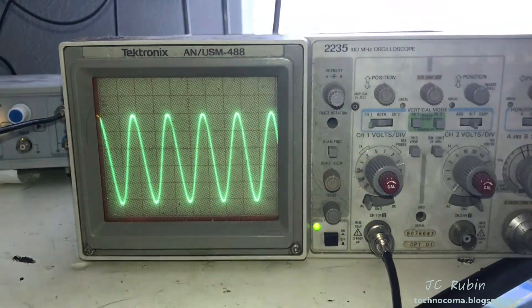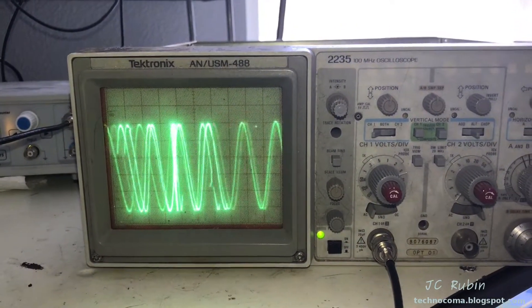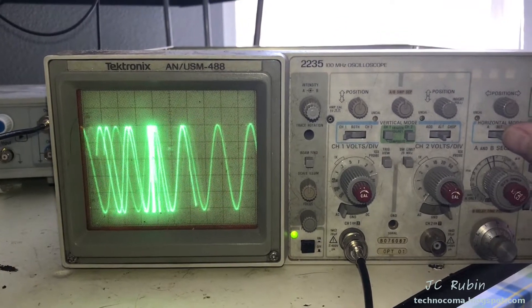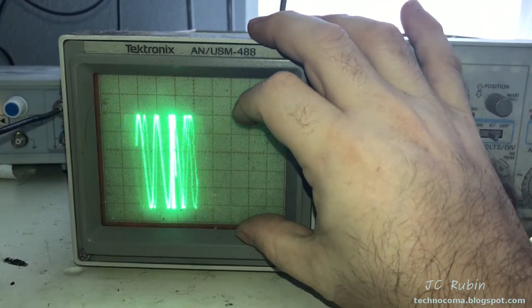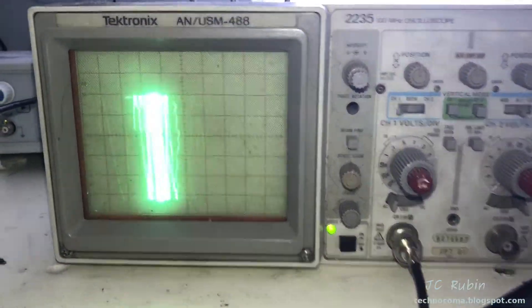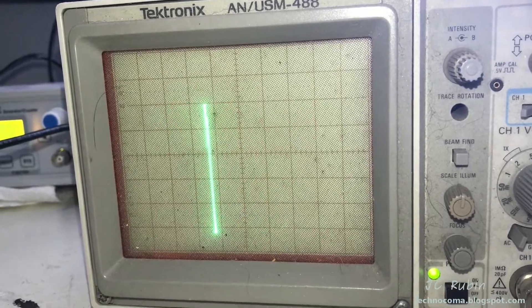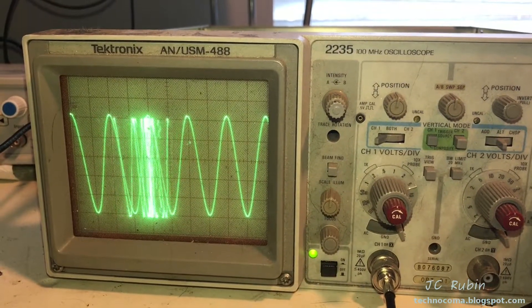I have a sine wave going through here. Horizontal mode is set up to B — everything works fine. We can see in alt, when A is mixed with B, what A is doing — not looking so hot. Sometimes it's good and sometimes it's missing, a lot of times missing the mark. And if we just look at it in terms of A, where I would generally find myself using this, we could see that the Y-axis is just fine as far as amplitude. But on the X-axis, it looks like there's a short of some kind where it lets go and the resulting value is exactly as demonstrated. One would ask if the problem is in the time domain — but you can see that adjusting it makes no change. The problem itself doesn't correct. So that is the problem in a nutshell with this oscilloscope.